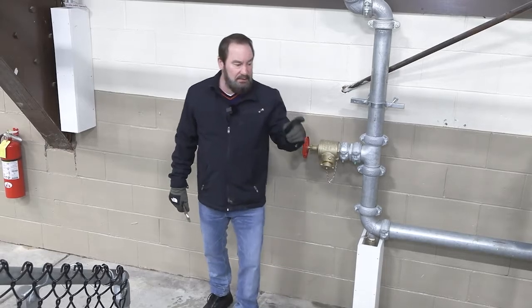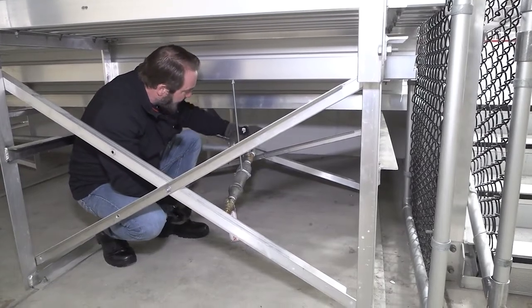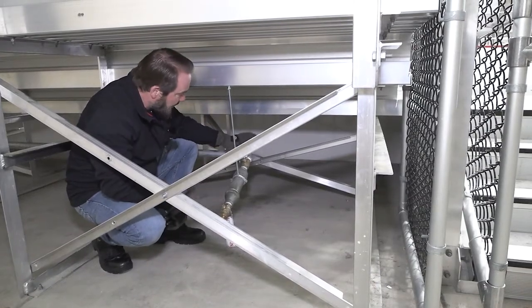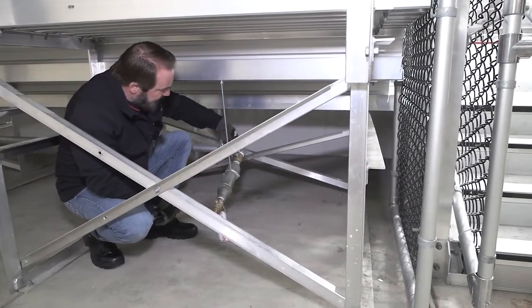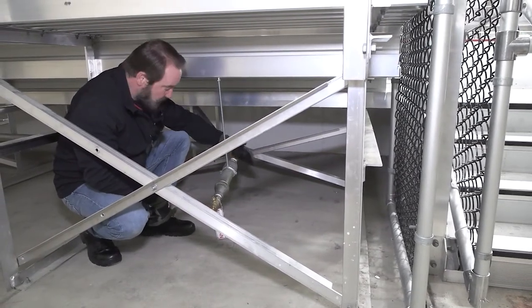On the next one I'm going to show you how to actually drain them. This is the typical setup inside the white boxes. This is considered the top valve — picture it swung down, and that's what you have on the other ones. The top valve should always be open three-quarter to all the way. The valve handle position indicates whether it's open or closed — if it's in line with the piping, it's open.